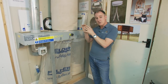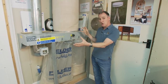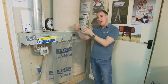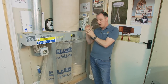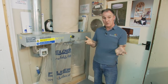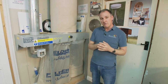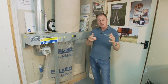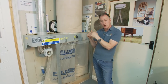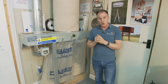Also in the winter time, this is pulling a lot of air in my workshop and the hot air is just being recirculated within it. But in the summer time it means the heat off these motors and the hot air is remaining inside. If this was outside it would drag all the hot air out in summer, which is great, but in winter it could dump that hot air outside. So what you probably need is a flow of air through a filtration system being put back into your workshop to maintain heat, but maybe diverted in summer to lose it.